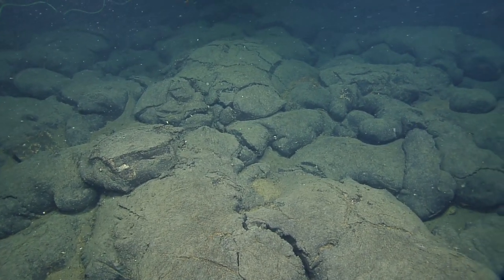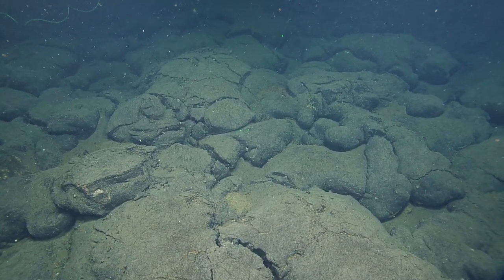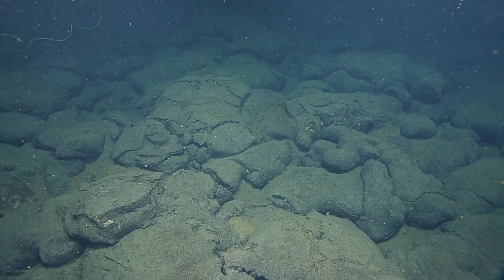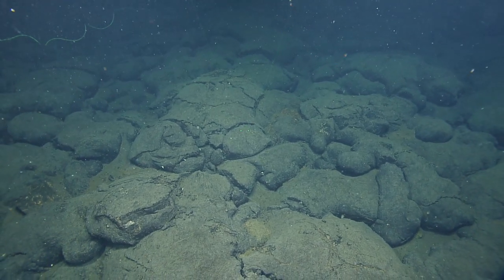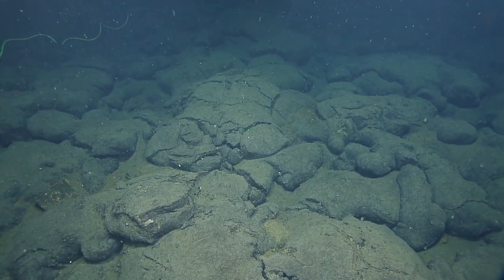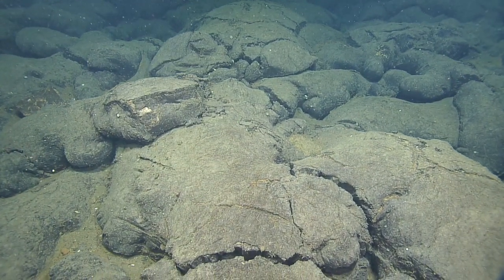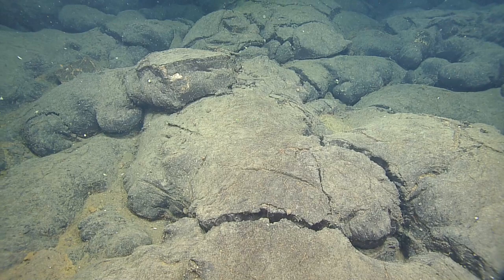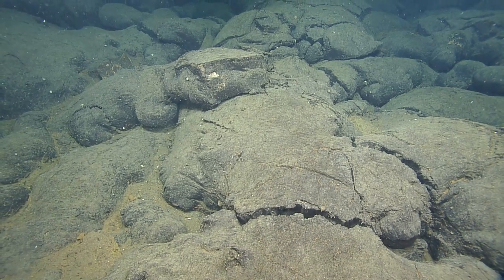So if you let go of the ROV and don't touch any controls, it's floating up very gently, a meter a minute, right? If you take a minute to get from here to here, that's how far the ROV has floated up. That's so quick. Conversely, if you thrust forward or down, you want to have the same descent rate. If you go faster than a meter a minute, it's hard to stop that 5,000 pounds before it hits the bottom. So for example, if I full thrust down and then let go, it's still going, but hopefully it's going to slow down by the time it hits. The more jostling you see on the camera, the harder you've landed the ROV. If you land it as hard as you can, it's probably not hitting the rocks as hard as when we landed on deck.